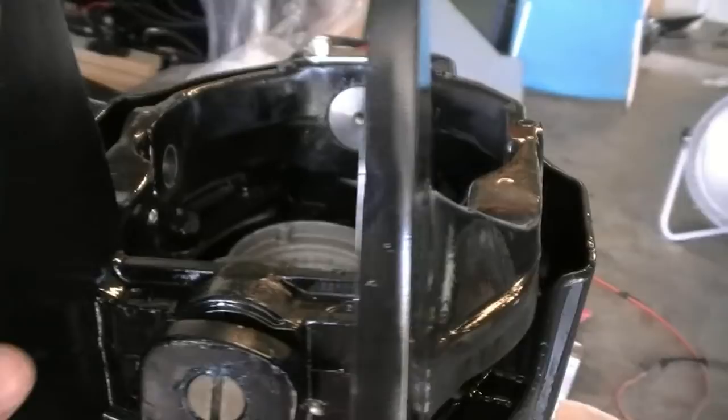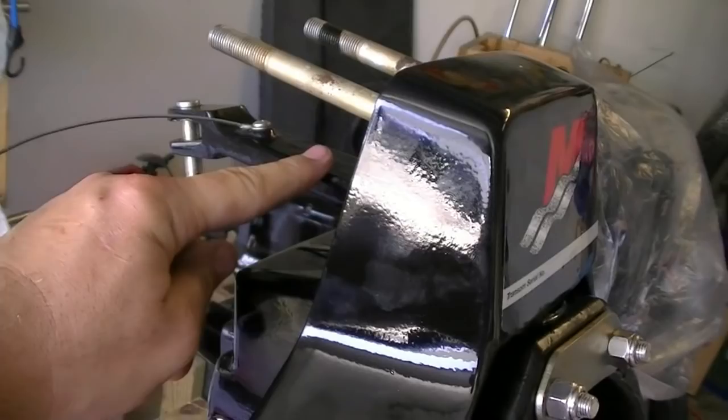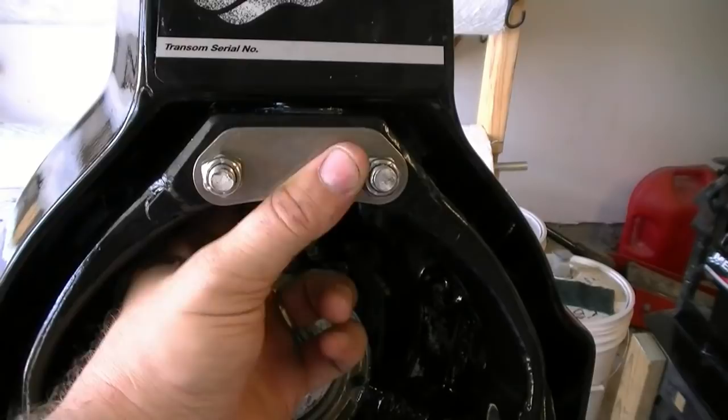One gimbal ring installed. This isn't as hard as I thought it was going to be. I got the steering arm on and it's actually torqued down to 60 foot pounds. We've got the U-bolt here. We used our big trusty torque wrench - I know this is way overkill but it works. We got our U-bolt installed and you always use a new U-bolt whenever you're rebuilding these because it's stretched out. These are down to 50 foot pounds and then we'll take it to 55 once it's had time to sit and stretch and crush some of this paint.